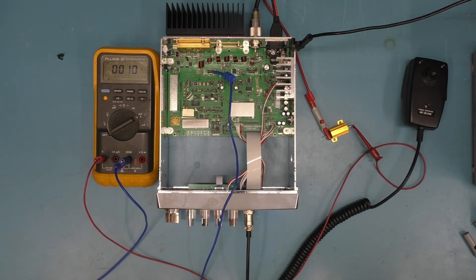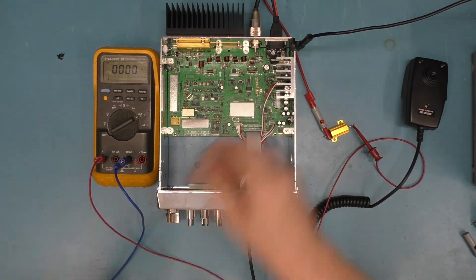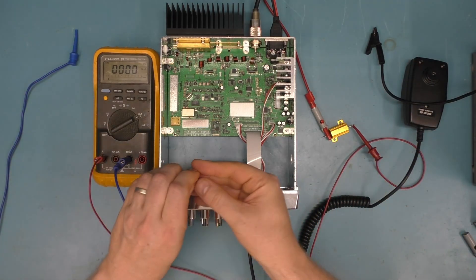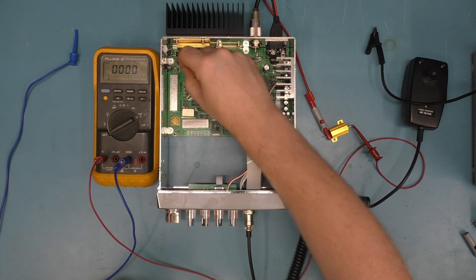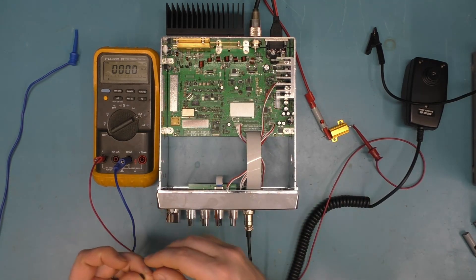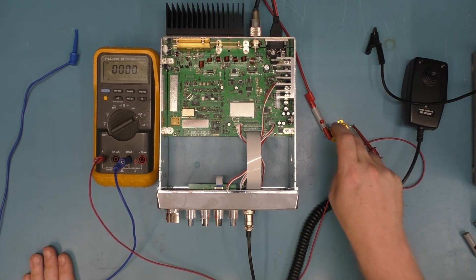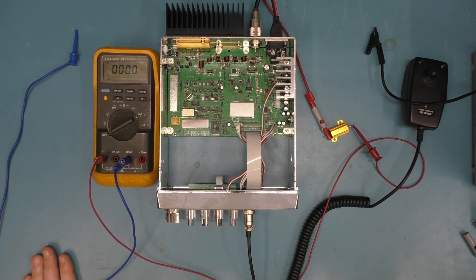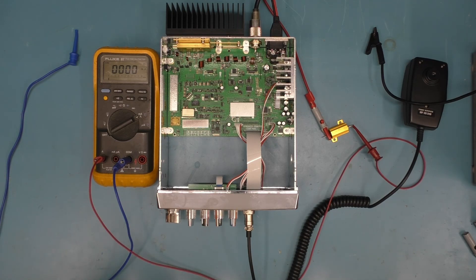Once you've adjusted TX IQ 1 to 100 milliamps, TX IQ 2 to 50 milliamps, and TX IQ 3 to the resting reading plus 20, the bias procedure is complete. Turn off the radio, remove the clips, reinstall the jumpers, and you're done. It's a bit more involved than the version 1 radio, but not that hard — you just need the second power supply and the ballast resistor. At the end of the video I'll put up a picture showing the test points in detail.